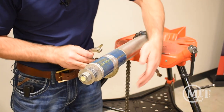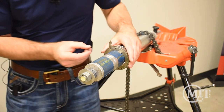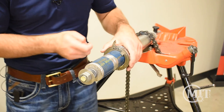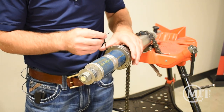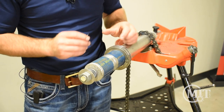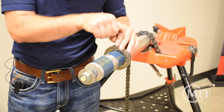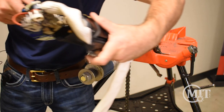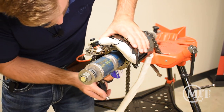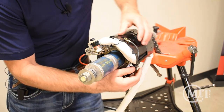Now we're going to set the D-Head up on a piece of pipe. The guide rings break in half — you mount it on the tube or pipe, and many welders create a jig so they can get it lined up quickly to the joint, perfectly centered. It clamps together, and you want to keep the start position the same each time. There's a hex screw at the top, so bring it around to the top and tighten it up. Once it's snug, mount the D-Head on the guide ring — you can feel it slip into the track — then bring the chain and link over, tighten it up, and you're ready to go.